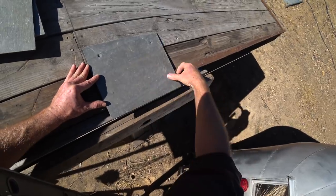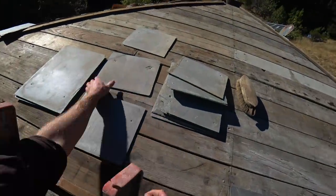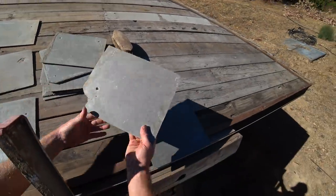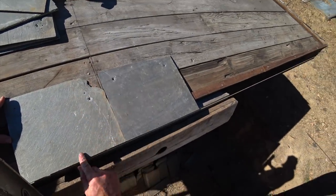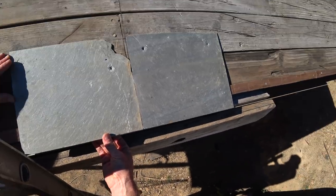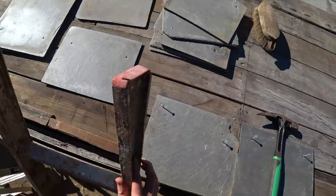These aren't really the same thickness - it's pretty close. But especially for the first couple here, I just want to get slates that match really well, because the next row of slate is gonna lay right flat on top of this and match at the edge. So if there's any major inconsistency in thickness that's gonna screw things up. Looks good, so just to be cautious I'm not gonna drive these nails yet.